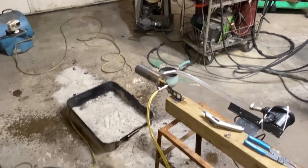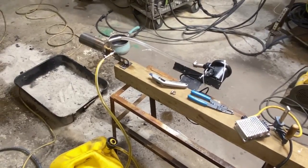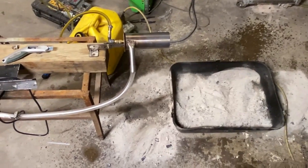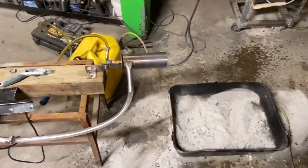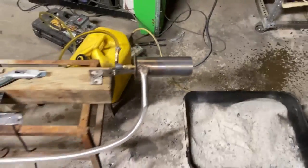This is going to go on a boiler for an organic steam system for a guy I'm doing some work for, and we're just trying to come up with a better burner than what I've got — something that doesn't need an air compressor. We may do the vaporization coil, I don't know yet. We're going to see how it works if it's just a little bit longer. I think what we'll do tomorrow is tack weld this extension on here and have a look at the performance from there.